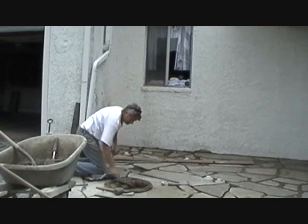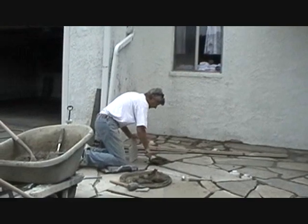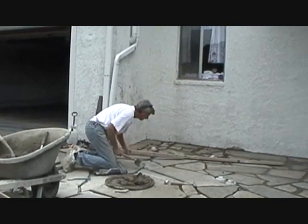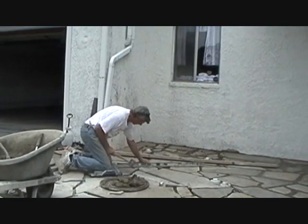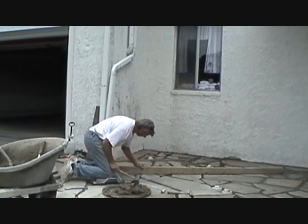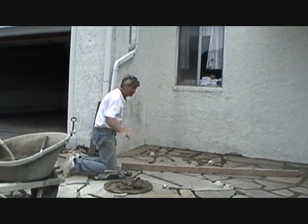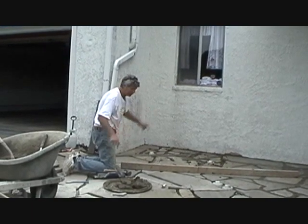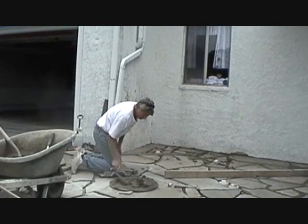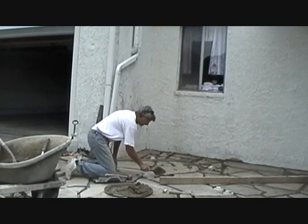What we're doing is we're laying the stone now, going even. This has a pitch on it so the rain comes off of it. They have spotters over one side. Every time we put our board down to one of those spotters, we know everything's pitched. We put it at 3% — that means 100 inches, you go down 3 inches. As you go, you can fill your joints or you can wait a little later and do it then.